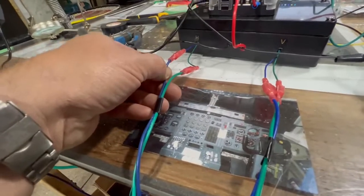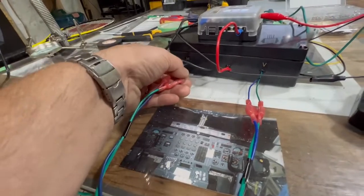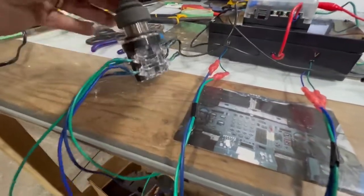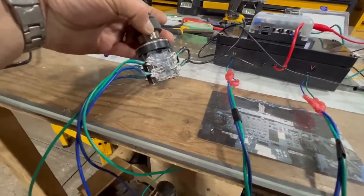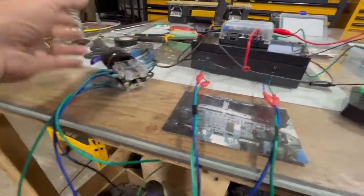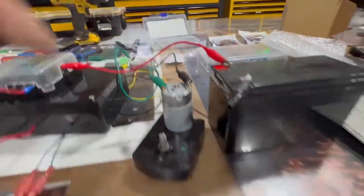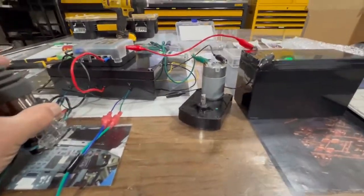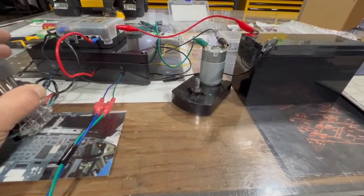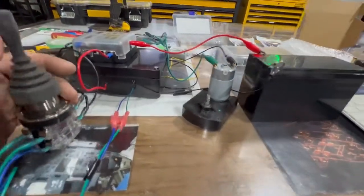To keep things simple I used blue wire and green wire, extended from the reversing relays. Here's the switch — green I put on the top, blue on the bottom, and that's all you've got to do. I have these two old Princess Auto 12-volt motors here to show you how this works. It's attached to the battery — this thing actually rips like crazy. One way and the other way — the reverse is fine.